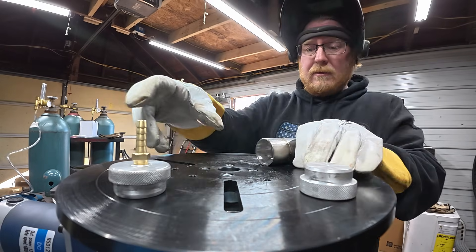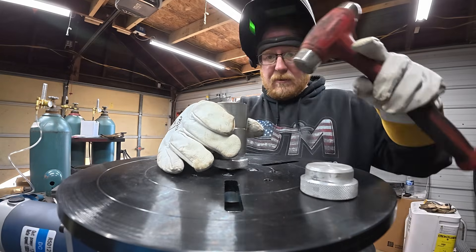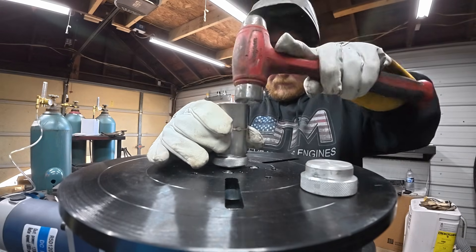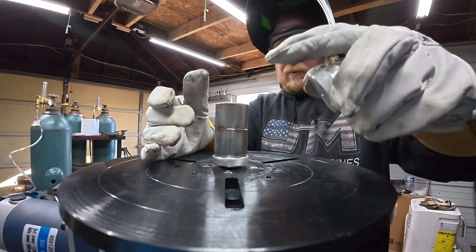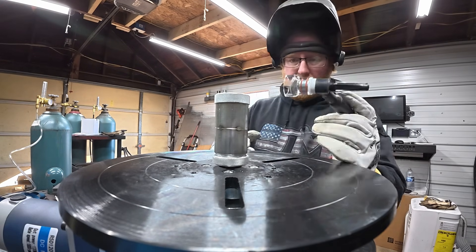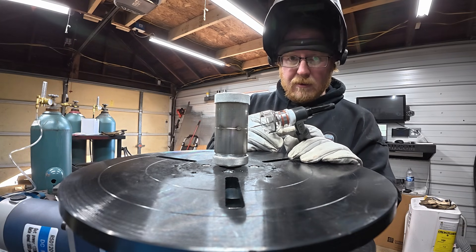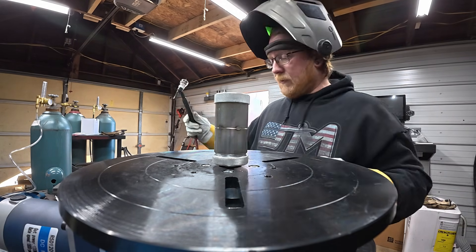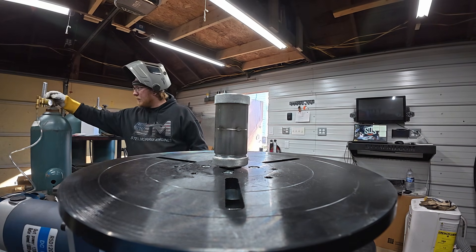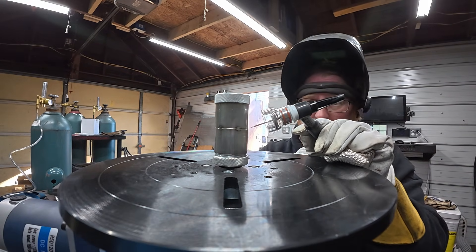The only thing I'm doing different is changing the cup size. Try not to put it on all the way because it's hard to come out. And instead of pushing it at an angle like before, I'm gonna bring it in more so it's straighter in — to try to cover it with gas on the backside a little bit. Turn the backing gas on.